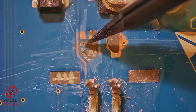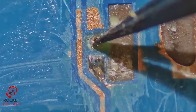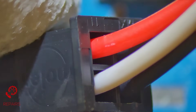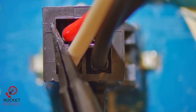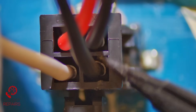Just here I think is actually a positive voltage rail. It's the tiniest wire available — being as zoomed in as I am, you can see we have the tiniest bit of copper exposing that trace. I have the plug here, and this red wire on the top left is where that goes to. The red one is most probably power, the white one probably signifies a data line, and then we have two negatives on the right — so those will just be ground.